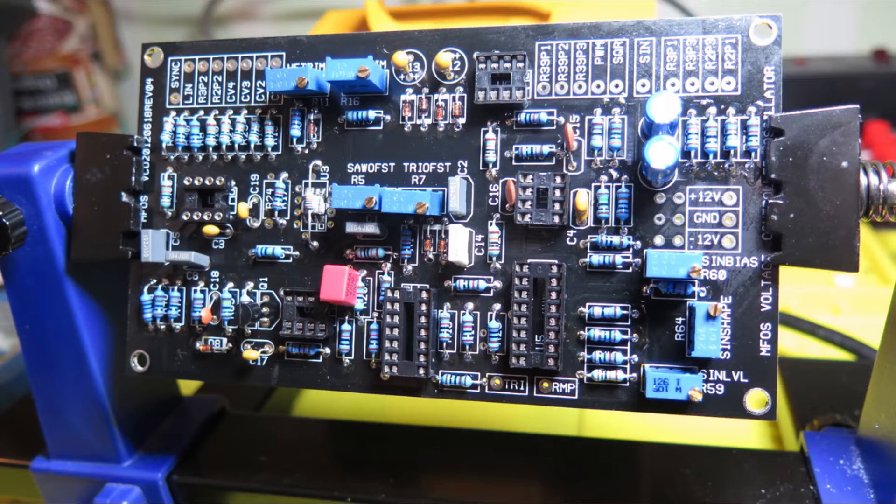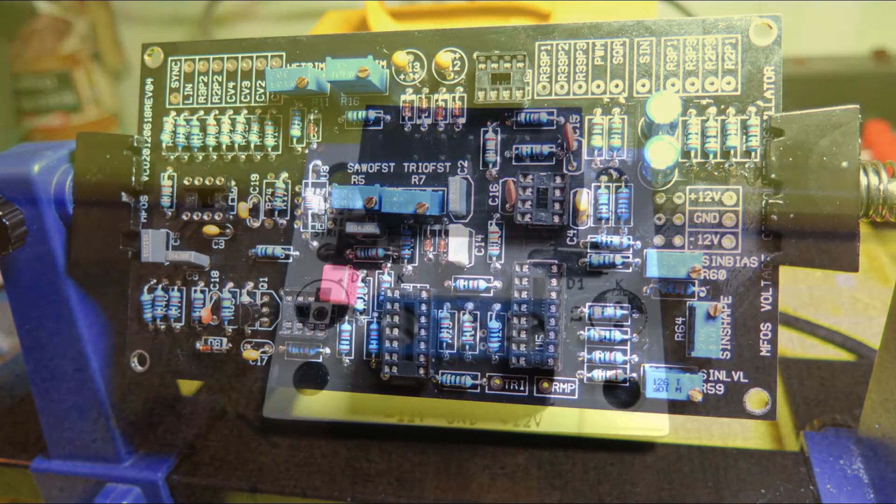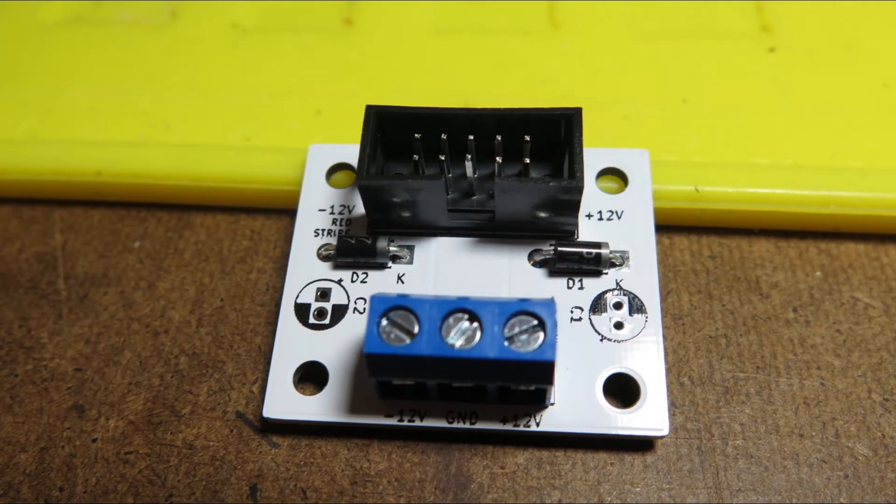For the power connection, Wilson wasn't designing for Cosmo or Eurorack — he just provided solder pads for each voltage and ground. To make it compatible with a Cosmo/Eurorack style power distribution system, a small custom board was built with footprints for a 10-pin ribbon cable header, a three-pin terminal block, power reversal protection Schottky diodes, and electrolytic capacitors. The caps and diodes can be left off and jumpered if not needed. This board attaches via a spacer and screw through any mounting hole, with wires running from the terminal block to the solder pads on the main board.